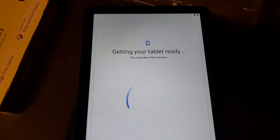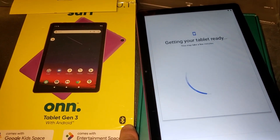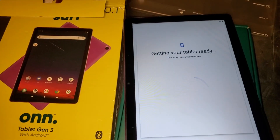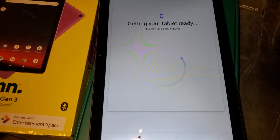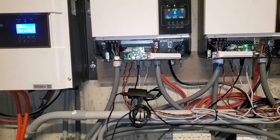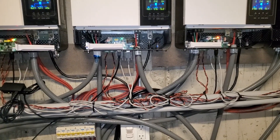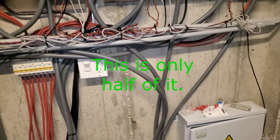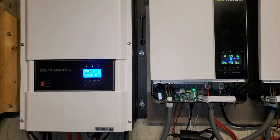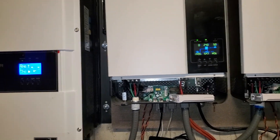Two minutes later it's still going. While I'm waiting, I have about 30 kilowatts of solar outside, and that's where the solar comes into the PV combiner box. It comes to 230-volt models driving a 12,000T because it has an auto transformer in it. It's been working fine, but sometimes the lights flicker and sometimes it does strange things, so it's time for this to go.